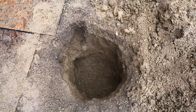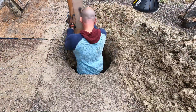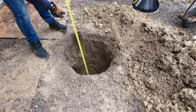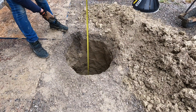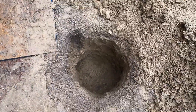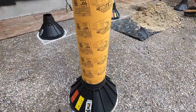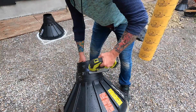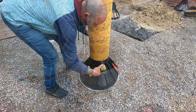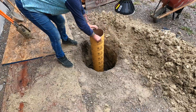The deck will have a full roof over it and could hold a lot of snow. Now that we're at our target depth, I'll pack the hole to firm it up. Clean out your hole perfectly before packing — never add soil. It needs to be undisturbed for bearing. Now that the hole is perfect, I'll prep the Bigfoot and form tube. Form tubes come in different sizes, so mark the Bigfoot leaving one fin inside the form tube and cut. Once cut, fit the tube over the fin and screw four to six one-inch wood screws. Now let's see how it fits.